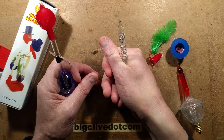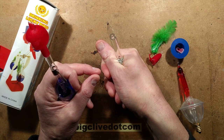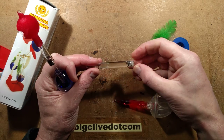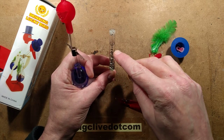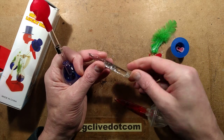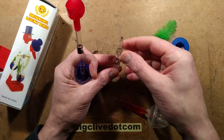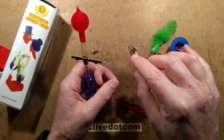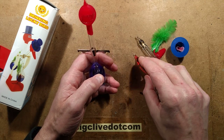When you do that, it takes so little to boil it. That's the principle of these tubes. If I shake this one down to get it started - there it goes, there's a few little bubbles going up. That's the principle of these bubble tubes. There's a lamp underneath, and there's rock salt in the bottom to trap the liquid - if you tried putting the tube upside down it wouldn't work because the liquid would just flow freely. What happens instead is it boils because it can't flow freely, the gas escapes, creating a continuous stream of bubbles. The bubbles go to the top, recondense into liquid, and it's a continuously repeating cycle. The same applies to Wurlitzer jukebox tubes - the bubbles actually get smaller as they get to the top because they're recondensing as they cool. Those are sealed glass tubes with this solvent in them.